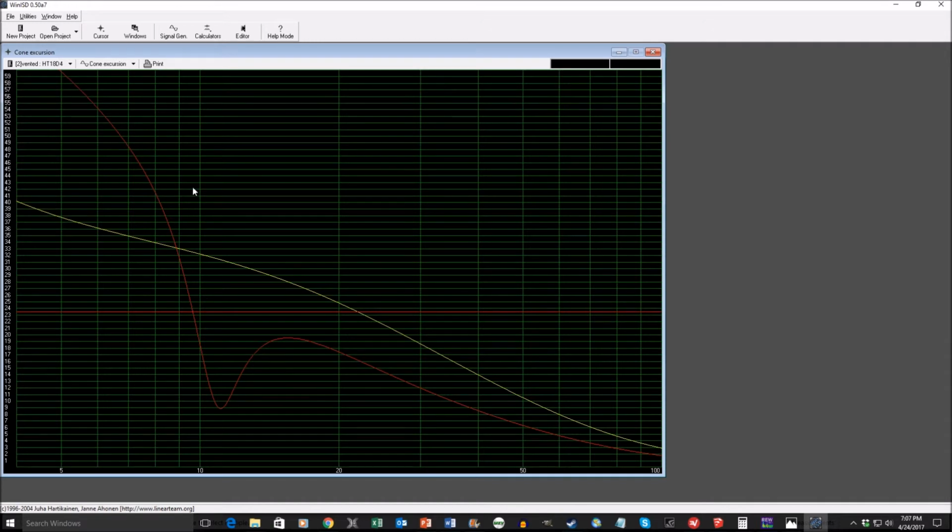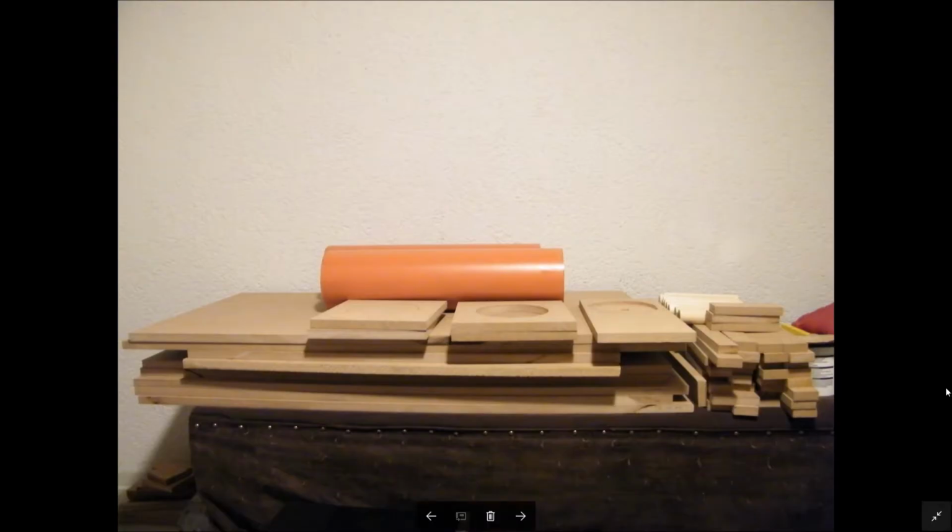And I should mention that if you have two subwoofers versus one, adding that second subwoofer gives you an automatic 6 decibels of gain. So whereas one subwoofer might play only to 109 dB, you put a second subwoofer in the room, both of them together are going to play up to 115 decibels. So what you see here is what you might call a kit for one Salerno subwoofer. Actually, it shows two pipes here that were used as vents, but actually just one goes in each one.